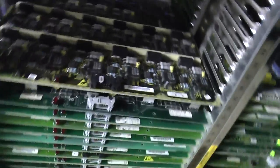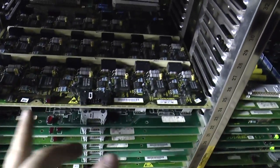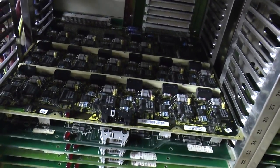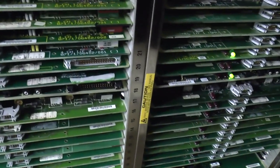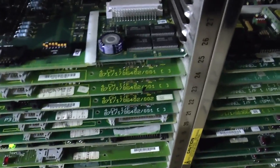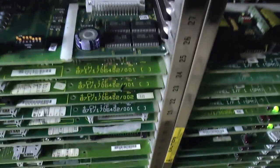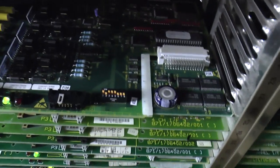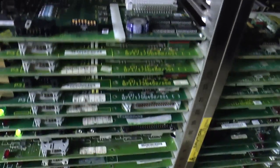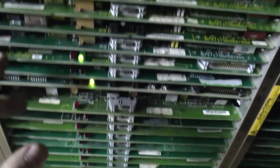There are rectifiers in there, more of them, and also big backup batteries at the bottom — so there's plenty of run time in this thing. Nice big fuses. Let's pop the hood on the DX itself. Much the same as before — here you can see some calls coming through and extensions. Same cards as before — the same card pairs: extension card and codec card all running through there. There's also a new combined extension and codec card, which is just a single card in one slot.